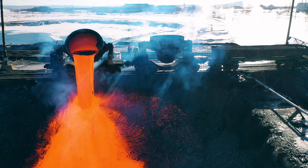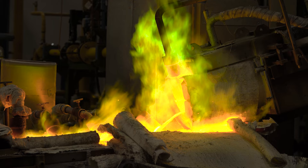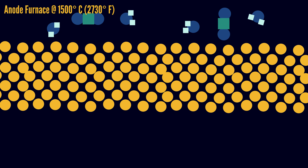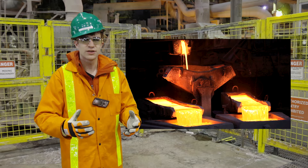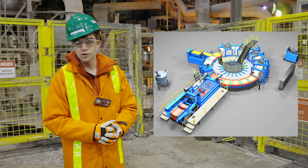Glowing in the cold winter's air, the whole thing reminds me of Mount Doom. Meanwhile, our molten copper oxide, now containing 70% copper by weight, flows to the anode furnace. This is one of the hottest parts of the entire facility, required in order to give bubbling methane enough energy to rip away that pesky oxygen atom. When the waste products burn off, giving us a nice green flame, we also get 99% pure elemental copper. The molten copper is passed through a series of channels where it enters an awaiting trough. Once precisely 380 kilograms are measured out, it gets poured into an awaiting casting basin, located on a turning platform which cools it down and passes it on to the next stage of the facility.